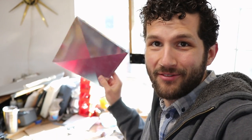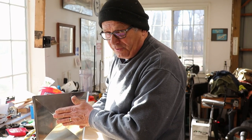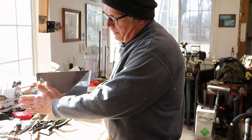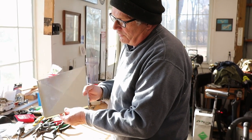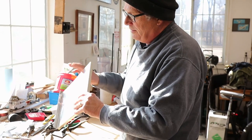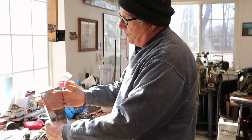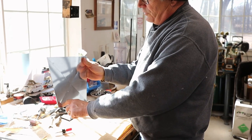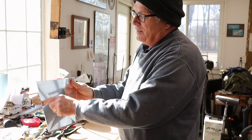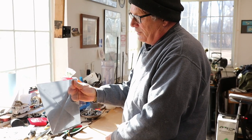We're back, and while we were away, some kind person snuck in here and fixed our screw-up — just kidding, it was Dad. Here are the new pieces for our radiator cowl. The only difference is we still have the one-inch flange here to mount on the grill, but underneath, instead of a 180-degree hem, because the aluminum is too hard to handle that, we just bent this at a half-inch 90 degrees and this edge at roughly 60 degrees. So when it's on the car, we still get the strength — instead of a hem we have a 90 here and about a 60-degree bend here, plus a light cross brake on the side.